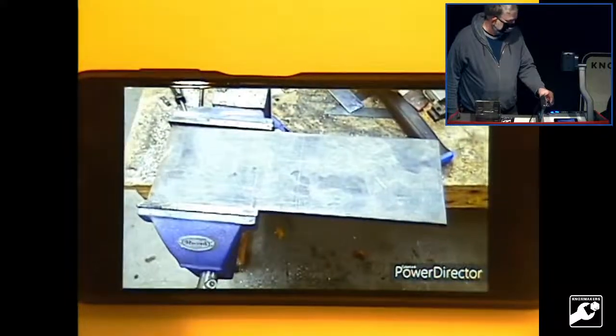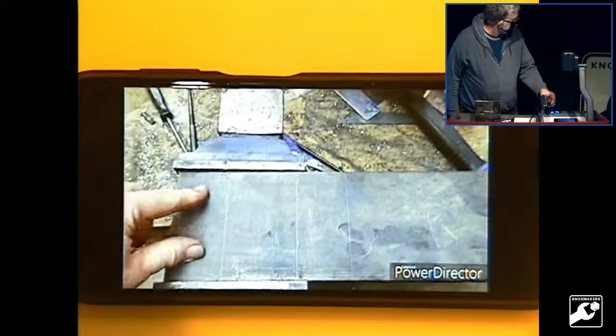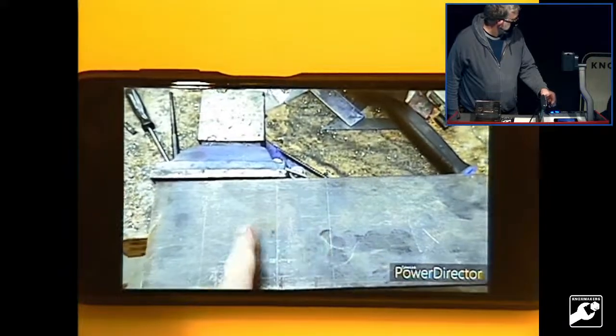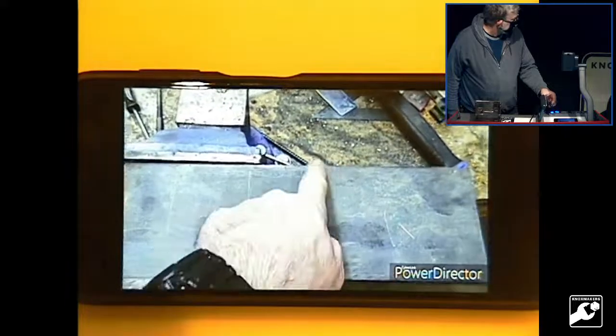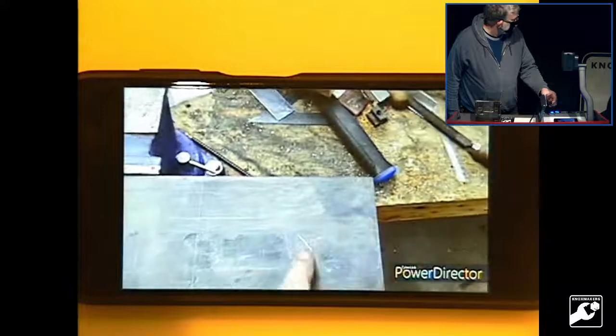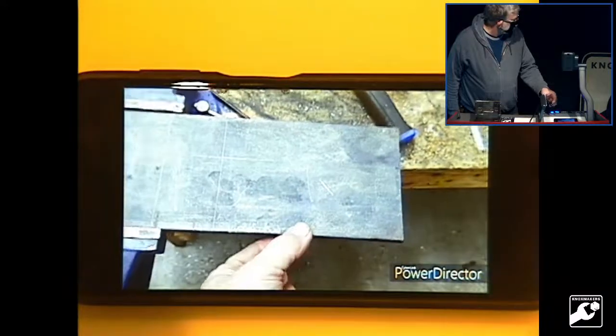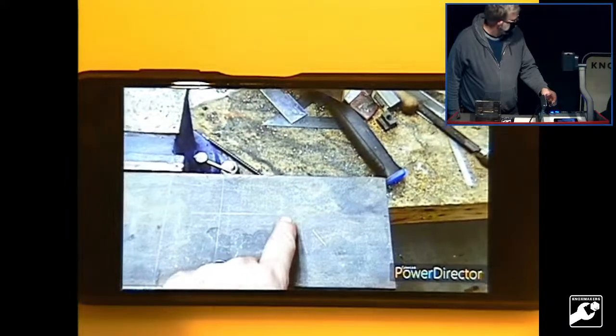This piece will form the base plate. The verticals will sit here and here. Forging will take place in the middle. And the offcut I will use to make the top and bottom dies. I'll then weld grade 8 bolts to them to reinforce the ends of them.